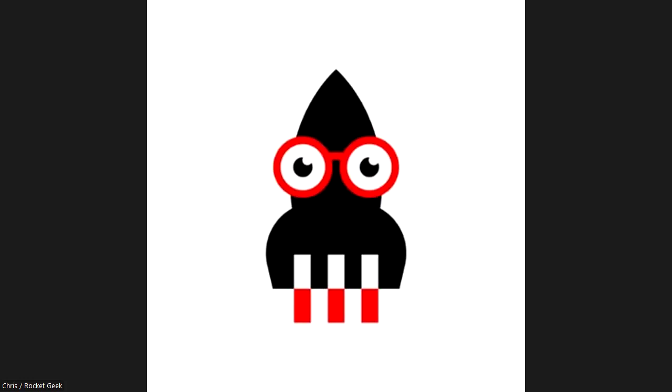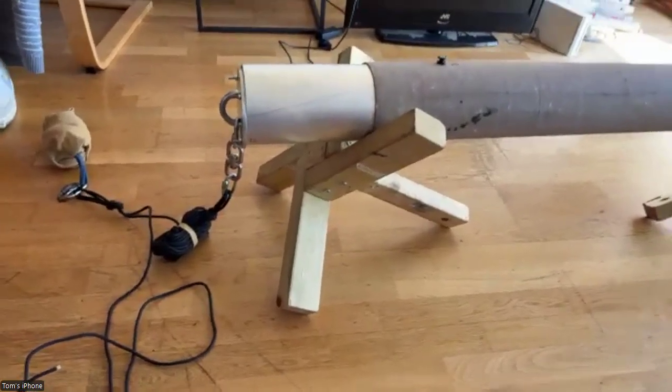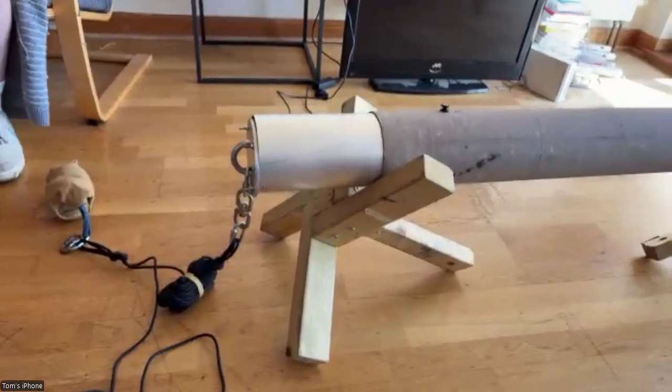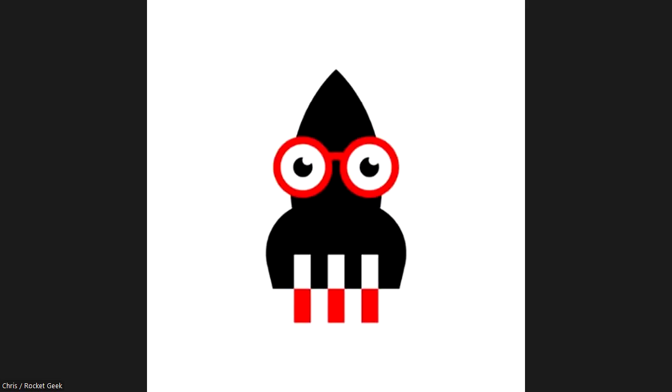So you're using phenolic or something similar as one of the tubes, yes? Our airframes are phenolic internally, and then a layer of fiberglass on top of it. So you've got dissimilar materials there, and I would suggest you come up with some sort of plan to make that a better joint.